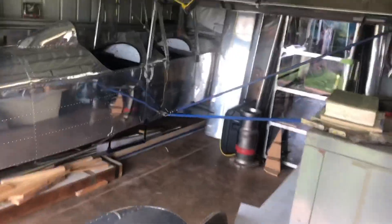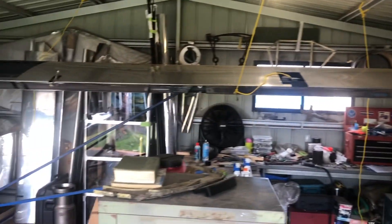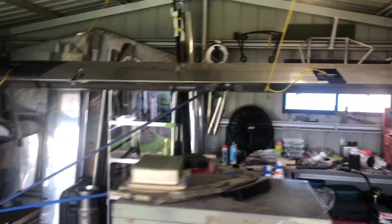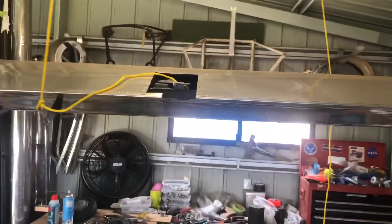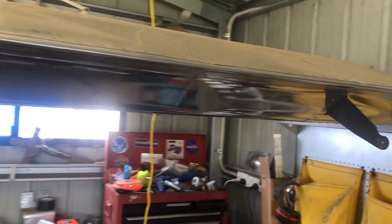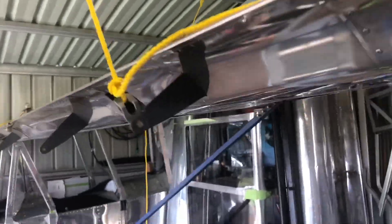Got the right wing attached. At the moment I'm just doing a wing strut, so basically everything I did on this wing I've got to do on this wing. My measurements: between the aileron points there's one degree dihedral, and then at the tip is one degree washout over the entire wing. That's what we're going for, and there's my wing struts progressing.